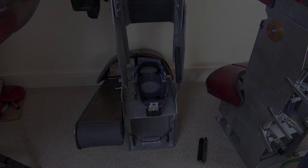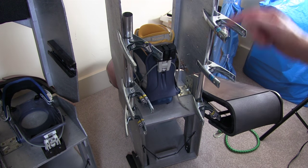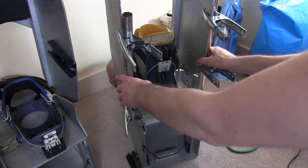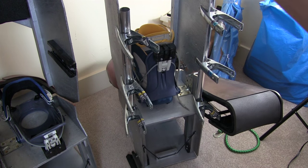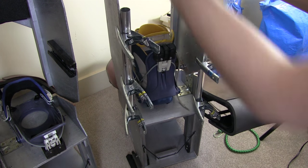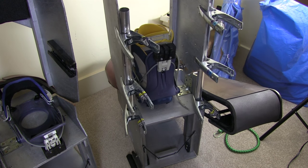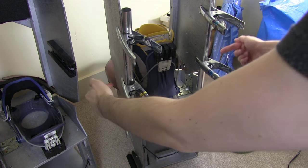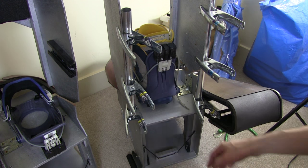Here is the other ankle. What I've done is just clamped in these poles — two aluminum poles — with two clamps on the top part and one on the bottom. Even though they're just clamped on with pretty loose clamps, I'm experimenting to see where I need to put the locking points. That stops it twisting; it won't move in any direction. It looks like two locking points on the shin or calf and one on each of the bottom works quite well.